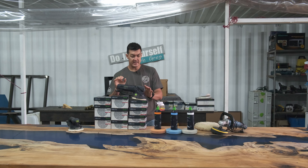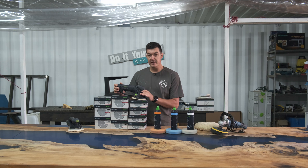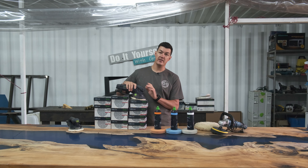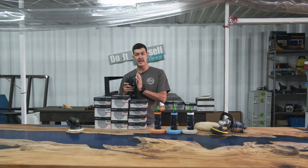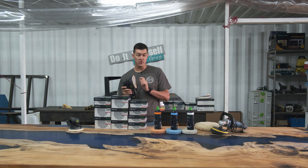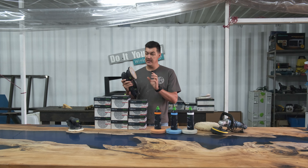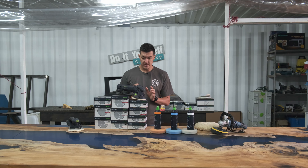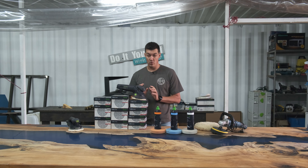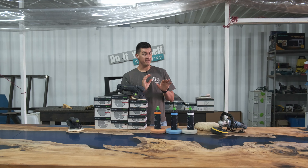There's something I said in that video that we've improved on. What I said was that when we start sanding our tables, we would typically start with our Festool Rotex machine in the rotex setting. Now, if you didn't know, the Rotex has two settings: your normal orbital sander setting, and the rotex setting. The rotex setting is a very aggressive type of sanding. The reason why we don't use the rotex setting anymore is our previous table we delivered — when we took pictures and videos of the final product.